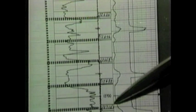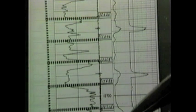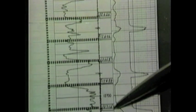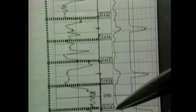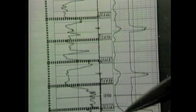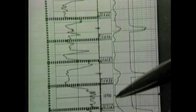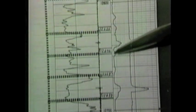We have three-and-a-half liner in a five-and-three-quarter hole. The well is around 12,900 foot deep, and our first turbulator is here at 12,712. We don't have room to show it, but the bond shows no bond up to this point until we come to the first turbulator here. Then, as we come up, we show real good bond all the way up through here.